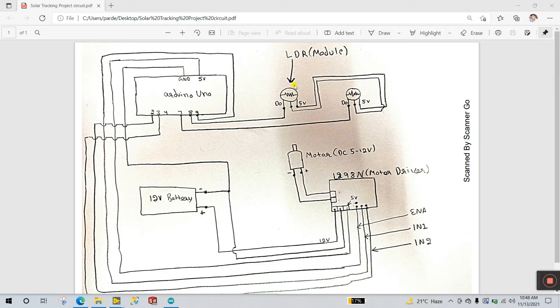Now the digital circuit diagram. You see the LDR module — we need two LDRs. The first LDR module's digital output connects to pin number 8, and the second LDR module connects to pin number 7. Follow step by step. Connect GND to GND and 5V to 5V, and connect this 5V and GND to your Arduino.